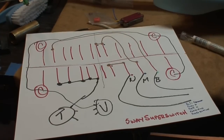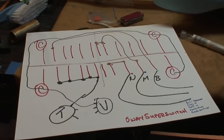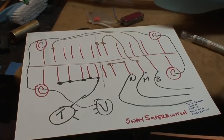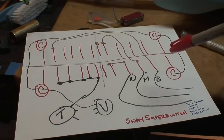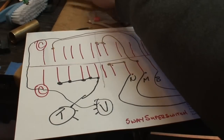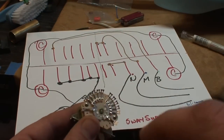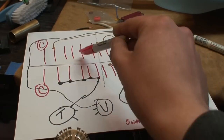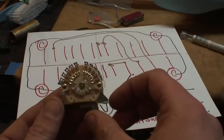See if you can follow me — I think I've come up with a good solution for my wiring. We have four outer lugs which are common, which get wired to our volume pot. That's fine, it's just like any other switch. But then each side of the switch has five lugs, times two.